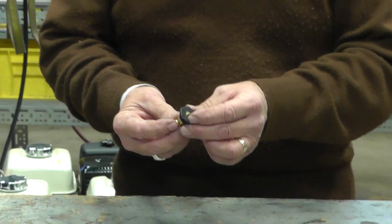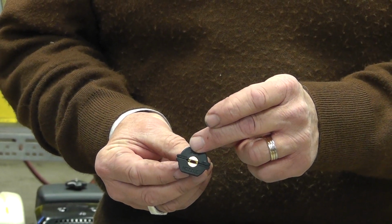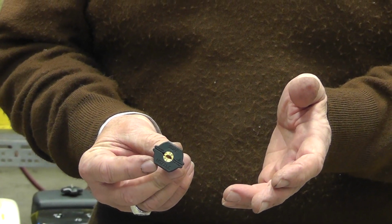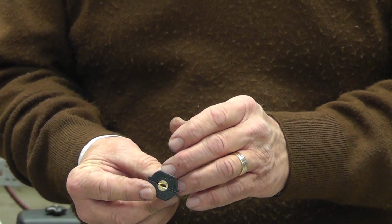You have the black soap nozzle. These are generally made of brass or plastic. They have a very large hole. They're a low pressure nozzle. They give you a very wide spray pattern, around 40 to 50 degree spray patterns, and it drops the pressure in the pump so that you can draw chemical and downstream chemical injectors.